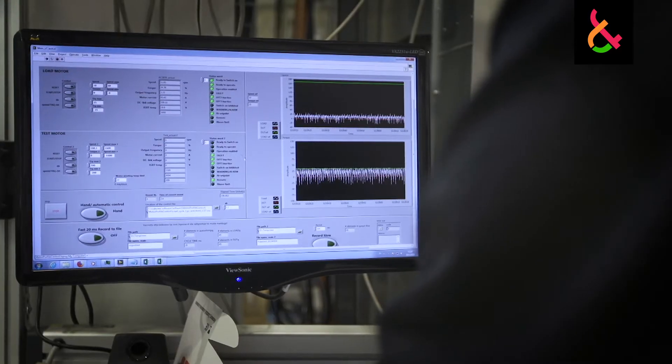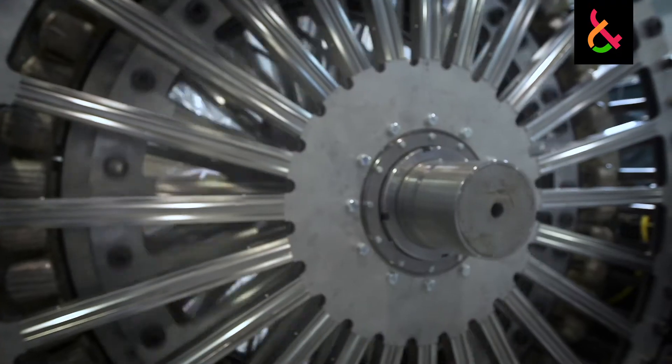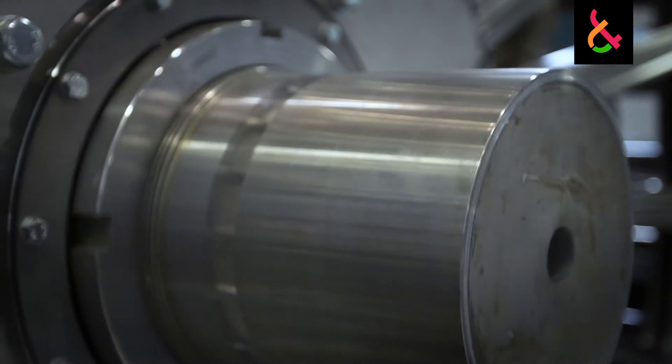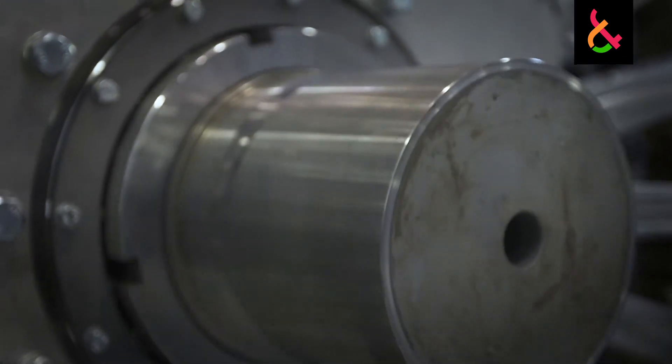When we put water through those coils we can keep them cool enough to increase the magnetic field that the stator produces, which drives the machine. This gives us more force between the rotor and the stator, so because we're able to produce a lot of force between them, we don't have to have as big a diameter — this machine is actually much smaller than an equivalent machine producing the same amount of torque.